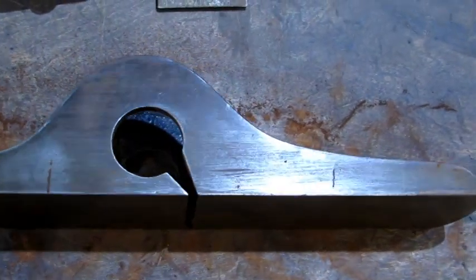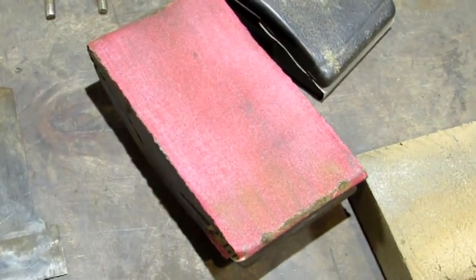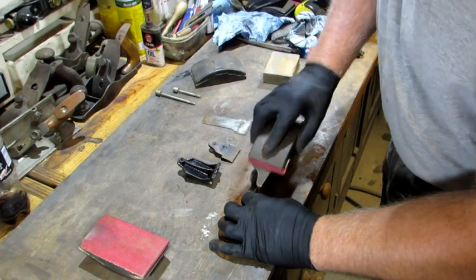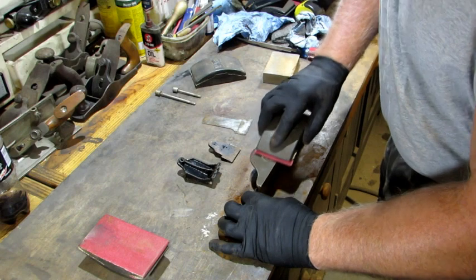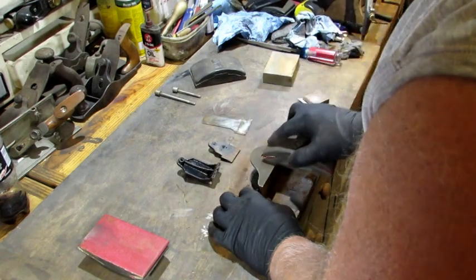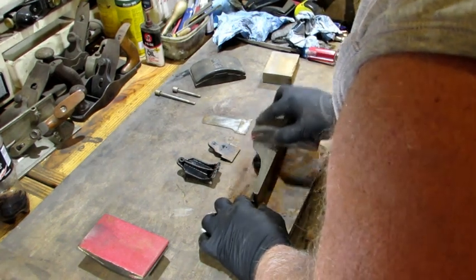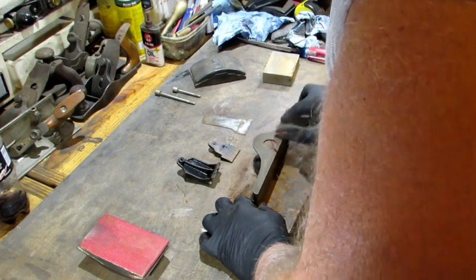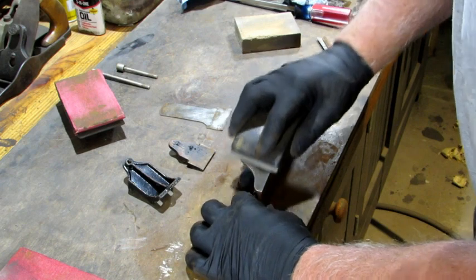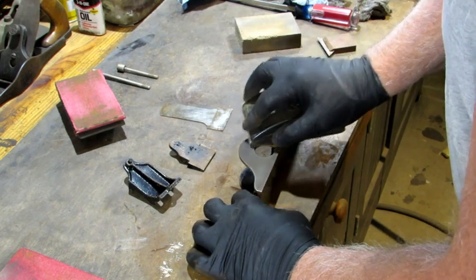The scraping does a fine job — it's looking good already. I did the same thing on the iron. Next thing I'm going to do is take a worn out piece of 150 grit and try to even up the patina on the flat metal surfaces. This is gentle, always with the grain — you can see the original machine marks. Applying more pressure where needed to even it out. It's all a matter of personal preference. After the 150 is done, I'm moving on to some 3000 grit — I'm not rubbing hard, this is just going to polish it up and keep it a nice sheen, getting it ready for a coat of wax.